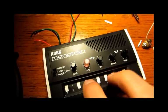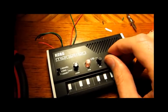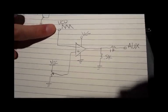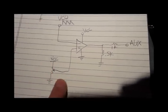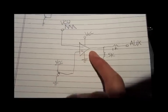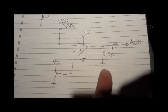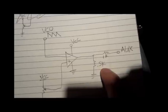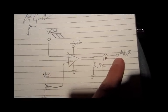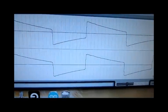Check and make sure it still works. So I've got this super complicated circuit here where it takes the raw VCO and compares it with a variable voltage made by a pot. That goes to a TL081 op-amp, which is just whatever I had lying around. And then there's a one-third voltage divider before it goes back into the synth so that it doesn't overdrive the filter. Here's a little plot of what the square wave waveform looks like.